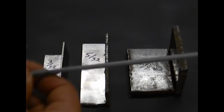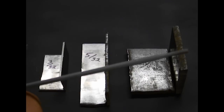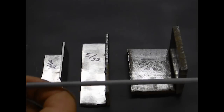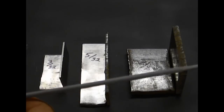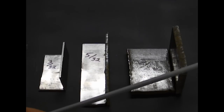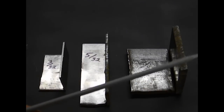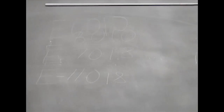Now once you increase the size of your electrode, you're also going to need to increase the amount of amperage that you're pushing to actually use it effectively. A smaller or thinner core wire, you use a lower amperage; higher core wires, you're going to want a higher amperage. If you're going a 6010 at 3/32nds, you're going to be working anywhere between 45 and 75. If you're doing a quarter inch 6010, you can be going as high as 220 to 325 amps.